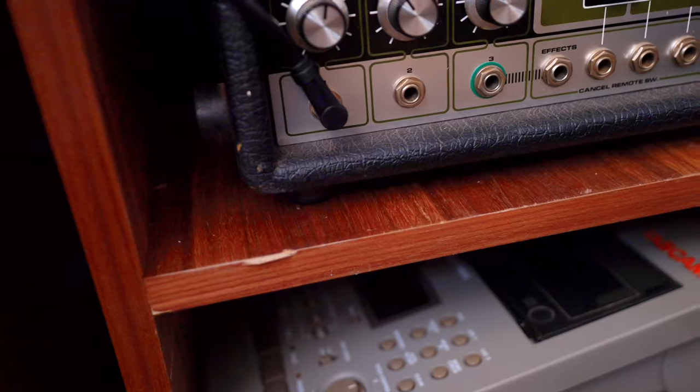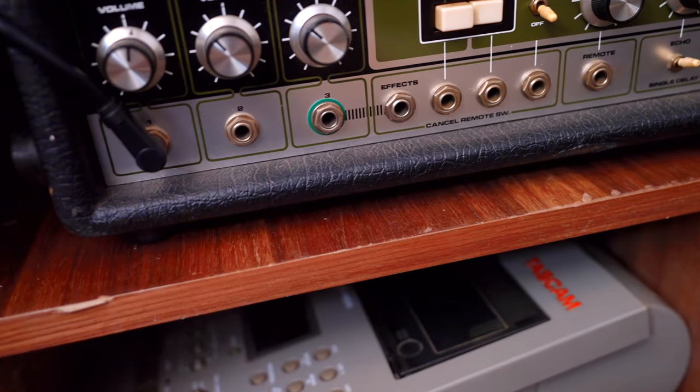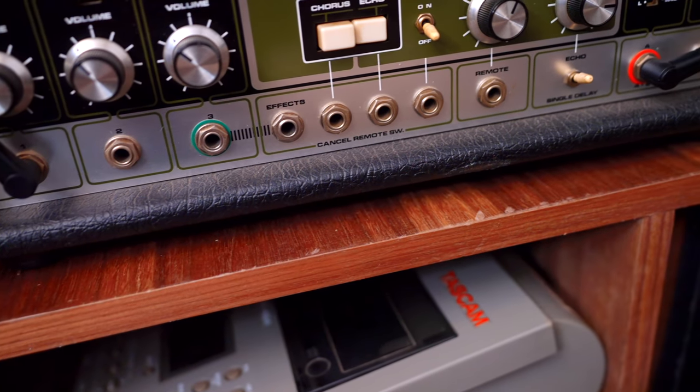I talked about how I hate edge banding at the beginning of the video. I've already had issues with the edge banding coming undone from just equipment hitting the side there. If down the road I don't have any changes that I want to make to this, I could take off all of the edge banding and glue on some solid walnut, and I could even get fancy with that if I wanted to, have it stick out a little bit, create some reveals and embellishments.